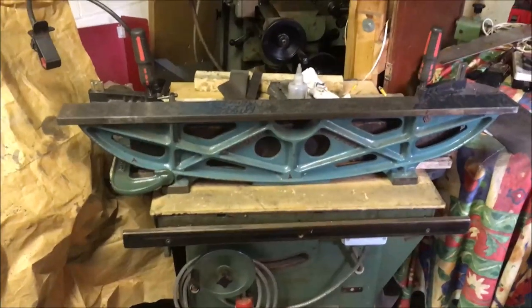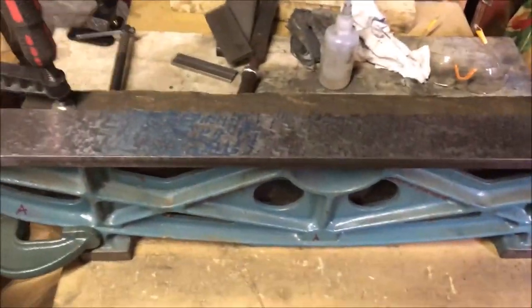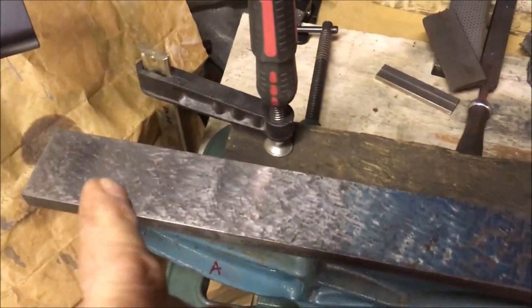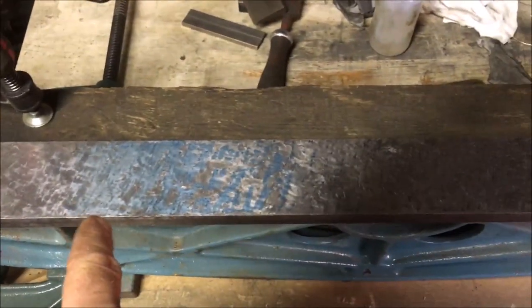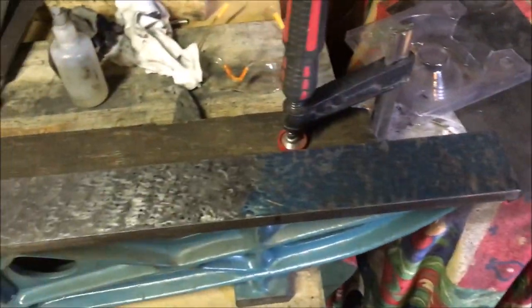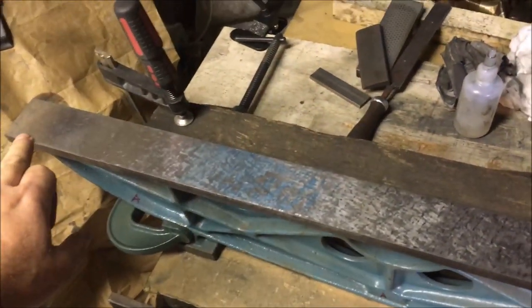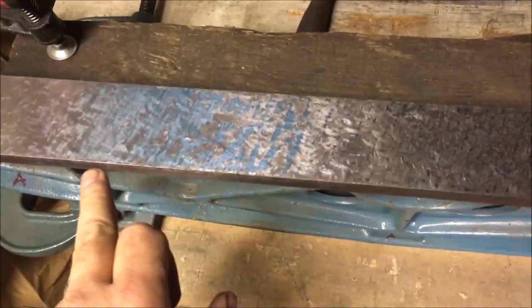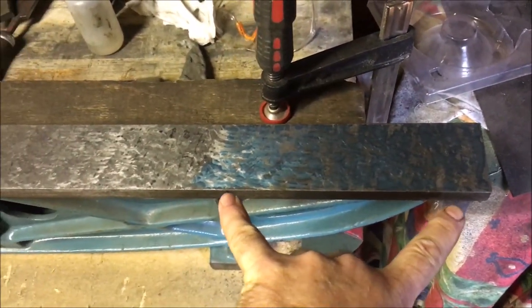Oh, well, we've moved on to bringing in the last 6-7 inches of the straight edge. So I want to explain the print. This is the end we've scraped to about here, the red lines there. And what we've done with the print is we've only overlapped it from here to the end of it. So clearly we know that from the red line that way it's all flat, and yet when we've printed it, we've only got about a 6-inch strip there and then 7 inches there.